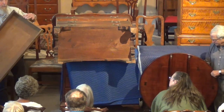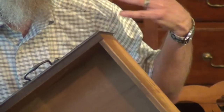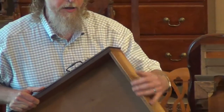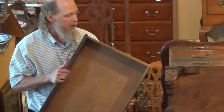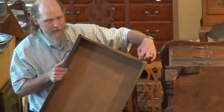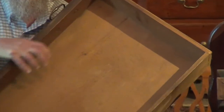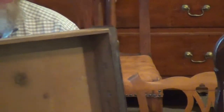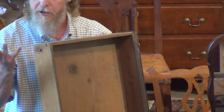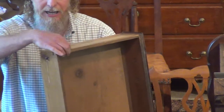This is a really subtle but important element — the shape of the edge of the top. It's one of those things a cabinet maker would do because of his training, not something easily copied by a competitor. Another important element in the world of Eliphalet Chapin's furniture is the way he shaped the top of the side of the drawers — there's a little tiny single bead on the outside edge of the drawer side. That is right out of Chapin's workshop and wasn't used by many other people in the area. So when looking at a chest to determine if it's associated with Eliphalet Chapin, look for that little bead on the outside edge of the drawer sides.